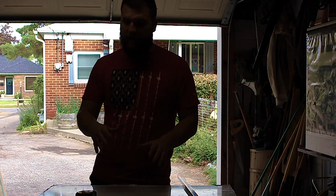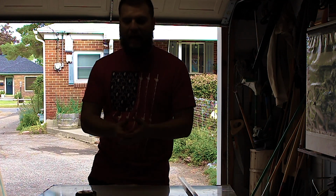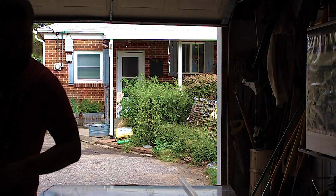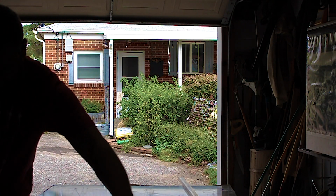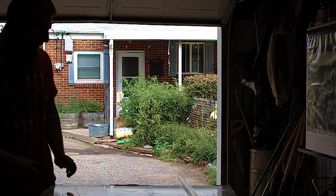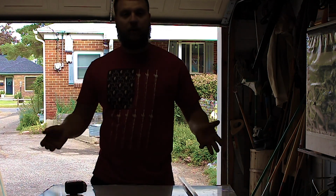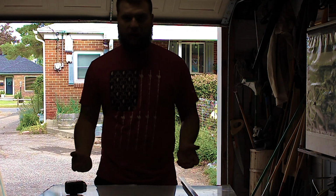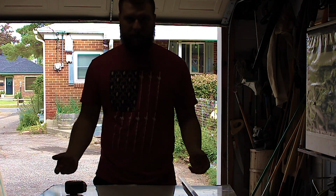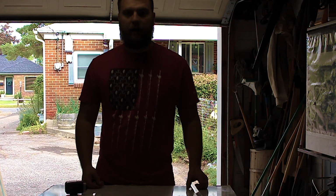We're going to be doing 15 and a half deep by, let me see, I can't remember 100%, 15 and a half by 17 and a quarter. Which will give him plenty of space so he can step on the pods, get back in the boat. Also give him at least 170 pounds of flotation for his motor.